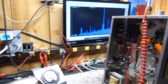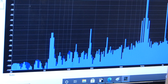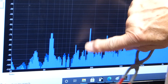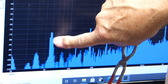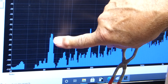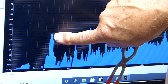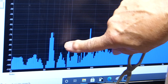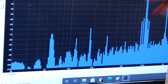Let's look at one particular point — let's look at the 120 hertz portion of the power supply. It's looking really good, and this is very important. 120 hertz is right there, that spot right there — the one jumping up and down. This is 60 over here; we're not worried about 60. We're not trying to deal with hum that might be coming from the filaments. That can probably be solved by putting a 50 or 100-ohm pot across the filament supply and grounding the wiper. But the one we want to work on right now, which is often a real problem, is the 120 hertz.